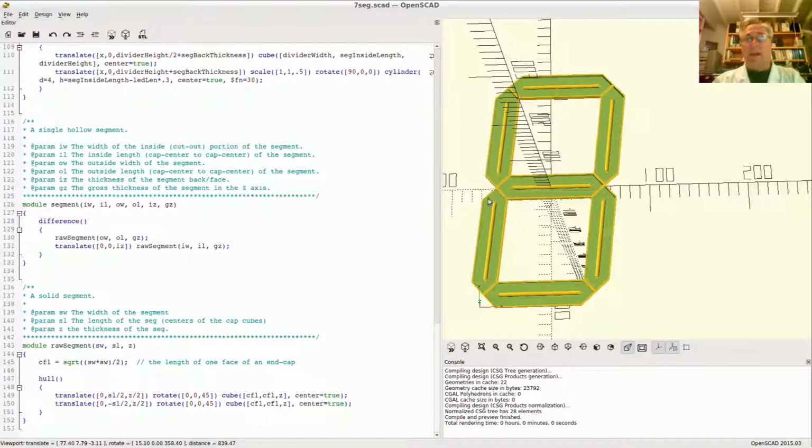And when I get to here I actually turn around and I come to this strip here, and then I go in reverse, inside the bottom and outside around the top. And then the wires end up with the strip here. So the data and the power goes in here, up and around, comes back down here where the data and the power comes out. And I can run the wires back out through the same hole. That would be fine. And that'll work every time there's an even number of strips.